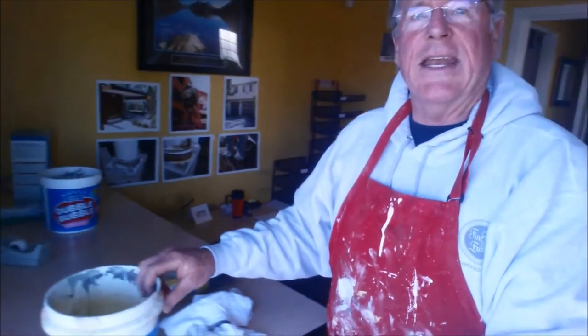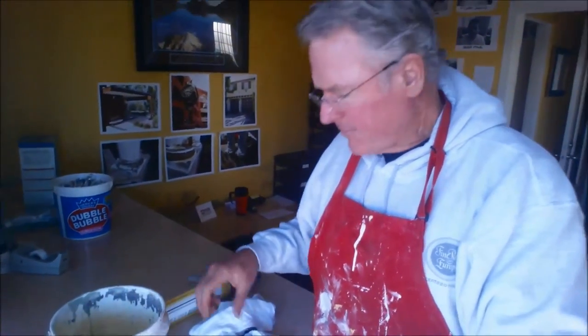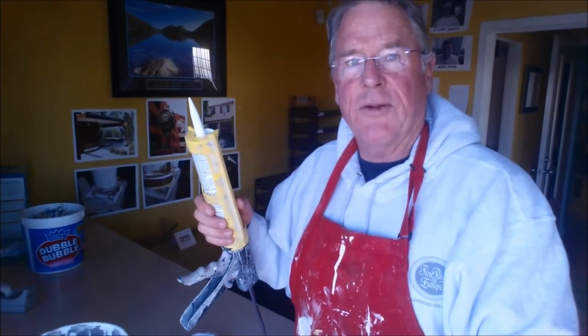The main purpose of this gate treatment is to caulk it. Normally you'd wait until you've primed the door before caulking, but the epoxy acts as a pre-primer so we're going to go ahead and do our caulking now. The three tools you're going to need are a bucket of water, a rag, and a good high-quality elastomeric caulking, because wooden doors like that tend to move over time — so you want something that not only sticks well but will move and flex over time.